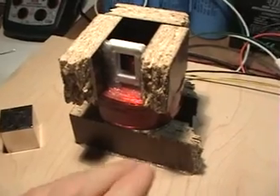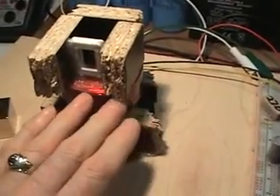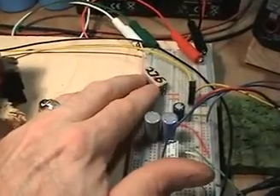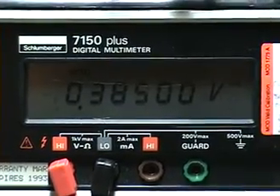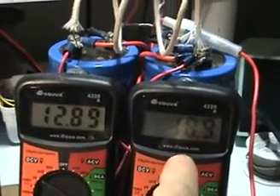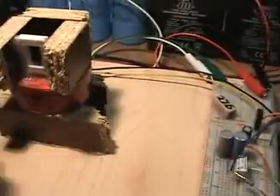Here's something very interesting: I've taken the magnet out. I'm sending the same frequency — just around 4 Hertz — with the same 276 ohm load, and after working for a while, the maximum voltage I can collect from the flyback is only 0.38 volts against that load. Look at the power — it's nearly double the input power going to the coil, and that's all I can collect of flyback.